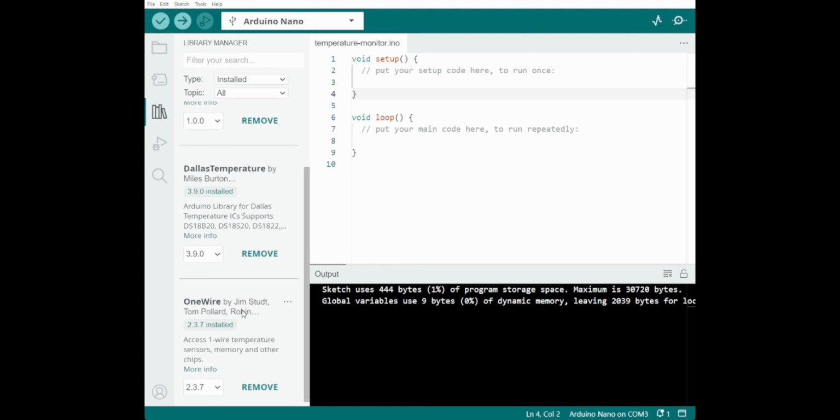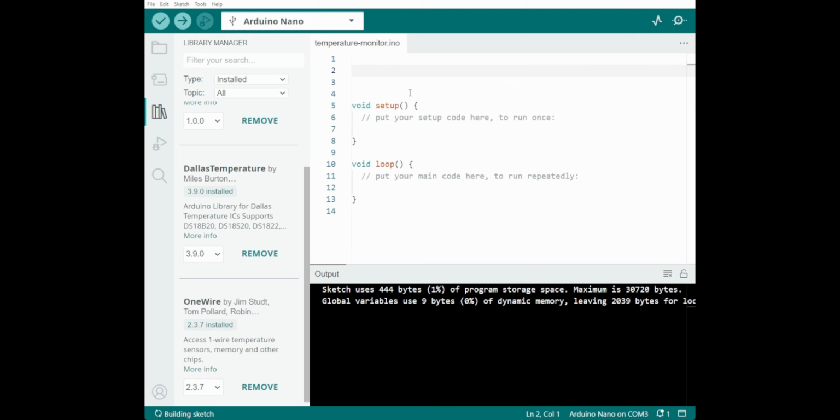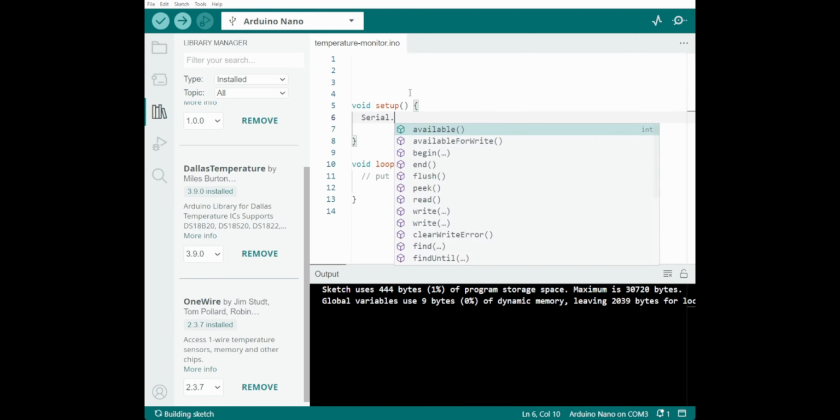actually, is that just by one? Oh no, sorry, I missed everyone else. Hover over this, there's a big list of people. So Dallas temperature and OneWire, or you can get them from the library manager in here. It's quite good. So first off, let's start off with the standard serial begin.